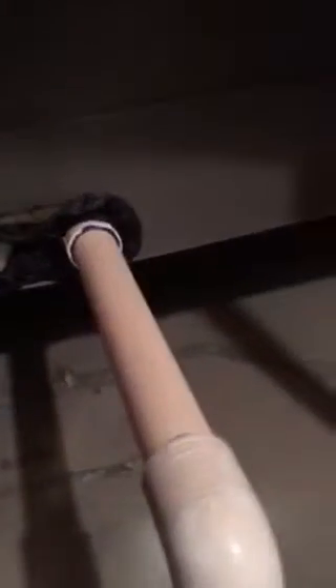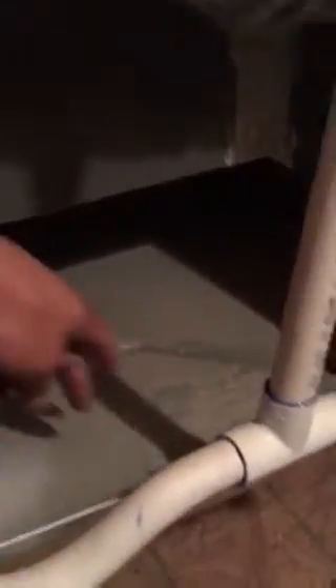So I will come down and discuss some options with you. We can go with something called a safety switch which would be installed here. We can also go with something called a flood preventer wet switch which would be installed here, to monitor any water and make sure we don't have water potentially backing up from the primary drain, which would then in turn hit your secondary pan.